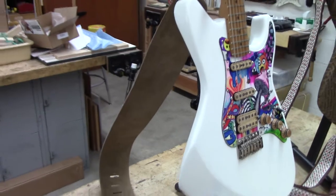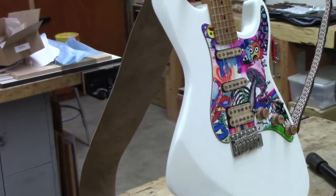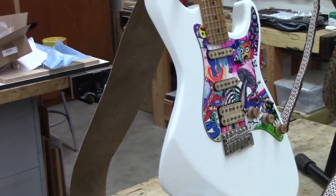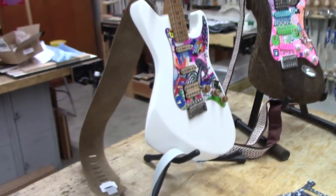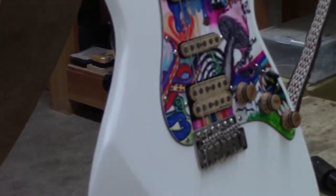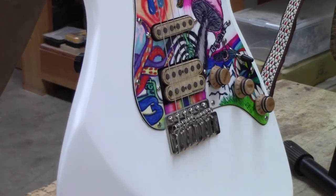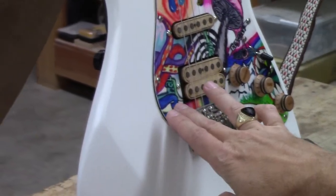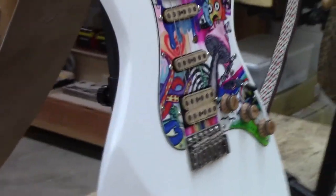She just did that with Sharpies. So what I did was I scuff sanded that with 400 grit and a little palm sander or random orbit sander. Just scuff sand it because the finish is very shiny and it does not take Sharpie well. So you need to scuff sand and abrade that. Then I used some inexpensive matte clear finish — I don't remember if it was a matte enamel or a matte acrylic — but it wasn't anything special because I really wanted the art to pop. I still think it'll be fairly durable since I did put several coats on it.